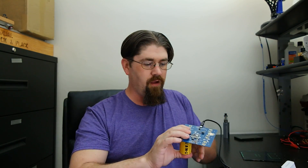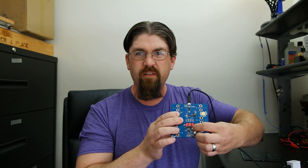We're going to plug into a wall outlet using a USB cable. When plugging in USB, do NOT plug it into your computer — this is not regulated and will pull upwards of 2 amps as the super capacitors charge, which will blow any port on a computer or laptop. Always use a dedicated wall outlet rated for 2 amps. If you use a half-amp or one-amp adapter the voltage will sag too much and it'll have problems charging.